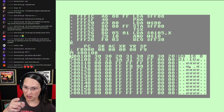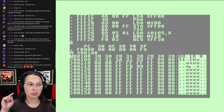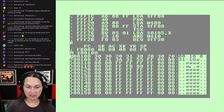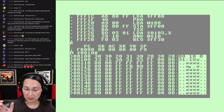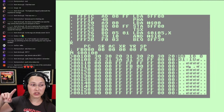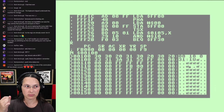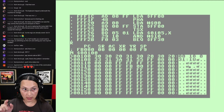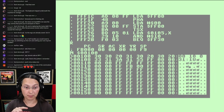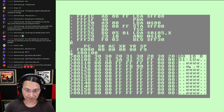The stack pointer is actually starting from the bottom and going up. So there's something to know about this. When the interrupt service routine fires, we're using up a bunch of bytes in the stack. So if that stack pointer is all the way down to, say, 0, for instance, it's going to wrap around, and it's actually going to start overwriting the stuff at the beginning of the stack. So as user program developers, we have to be mindful how many subroutines we jump into in our main program. If we jump into too many, we'll end up with a stack overflow, and it will clobber our stack and screw up things later.